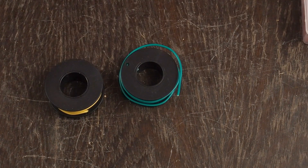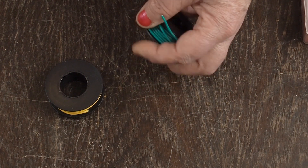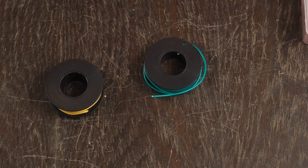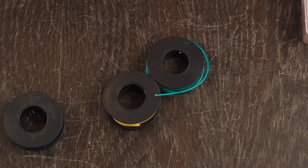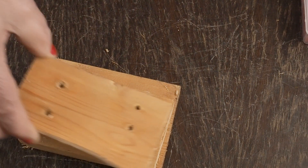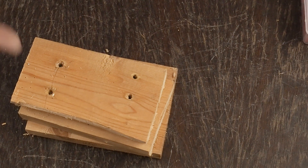The last supply you're going to need is some wire. I use 18-gauge solid core. I make sure to get the kind with insulation rated for 600 volts so I can use it on all of my tube projects. Get at least two or three colors so you don't get confused when wiring the inside of the amp. And the last thing you're going to need — available at your home center — is some one-by-four scrap pieces of wood. You'll cut them to different sizes to support the underside of the top of the chassis while drilling and punching holes so you don't dent it, because it looks really ugly when you do that.